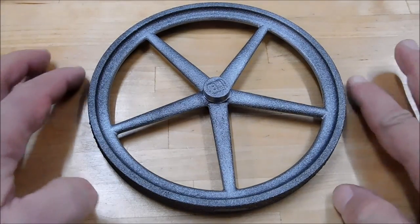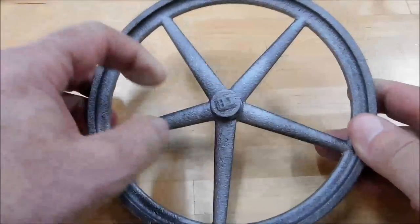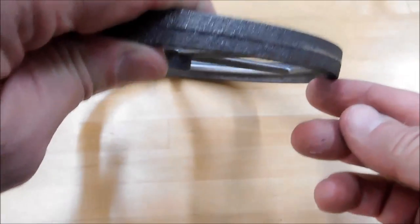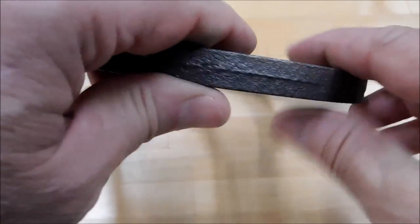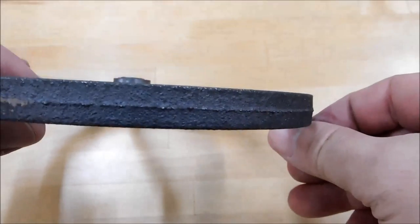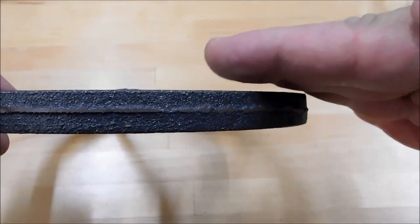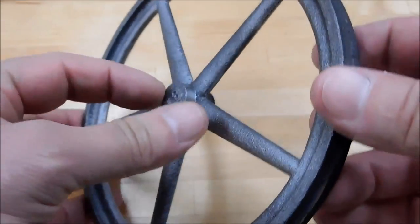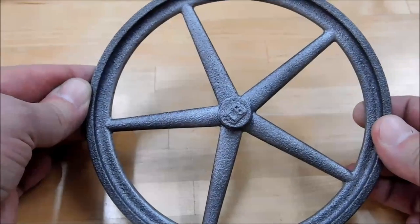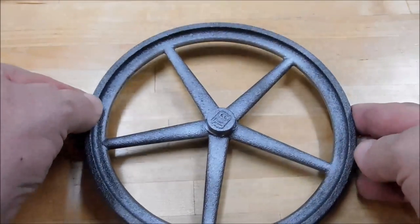Let's talk about a very unique situation that we have here with a very unique solution. I just clamped on this diameter, which is running eccentric because the casting is split. You can see how it shifts to one side. That error will get worse. It will neutralize, and then it will return to the other side. Now, the eccentricity that I am trying to dial out is greater than the movement of my adjustable chuck. So here's the solution.